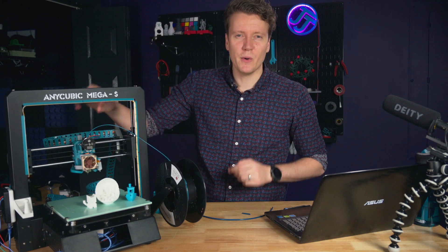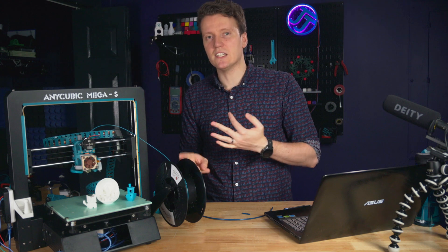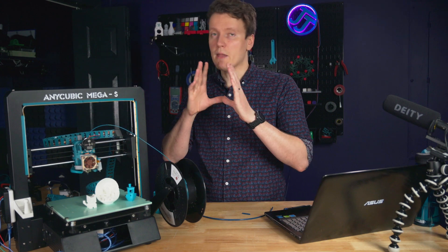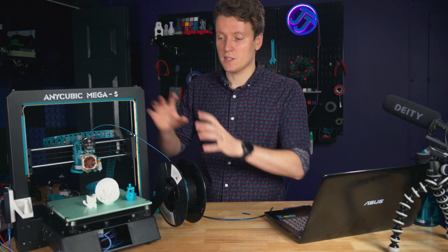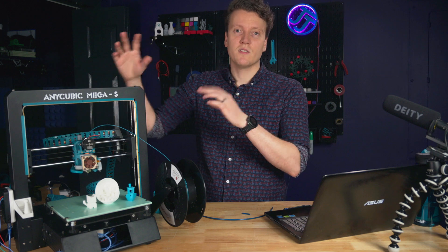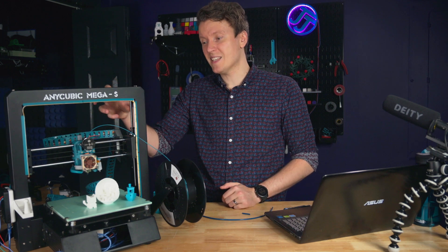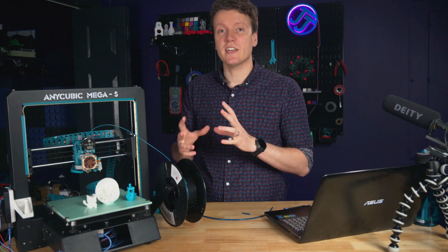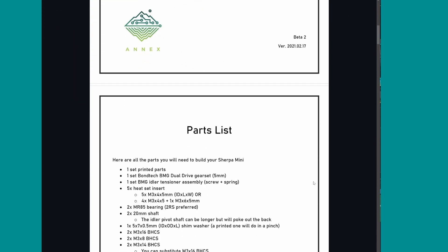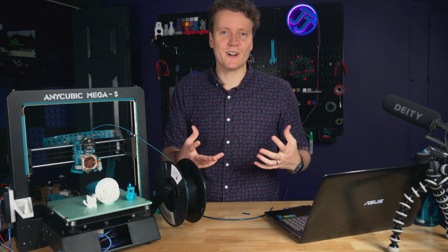Since the extruder is crammed up next to the motor, any heat could deflect the printed parts if you use PETG or PLA. ABS is kind of tricky, especially with a printer that's not enclosed, but you can buy those parts from somewhere else since it's such a small number of pieces and easy to source. Putting it together is very quick and easy — there's a document on the Sherpa Mini GitHub that steps you through all the steps.